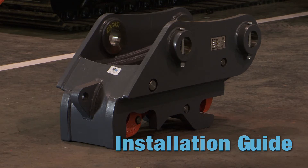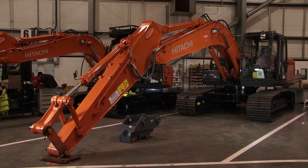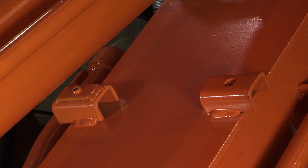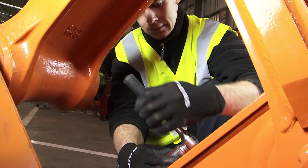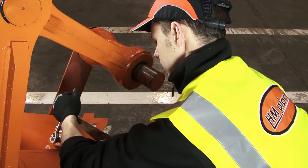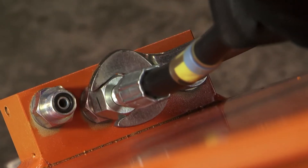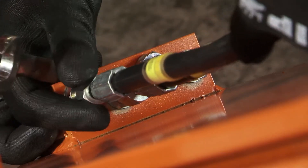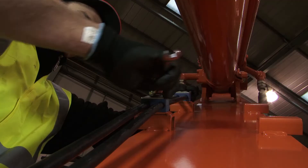There are some basic points to be observed when installing the Hill Tefra coupler. Mounting brackets for hose clamps should be carefully positioned and painted after welding. When installing hydraulic hoses, ensure that they are run neatly and clamped to remain in the correct position. Take care to avoid any contamination and tighten all connections to eliminate any risk of leaks. Hoses should be positioned with the coupler crowded to prevent overstretching and damage to them.